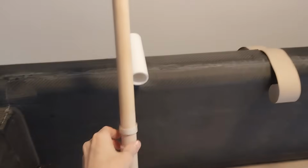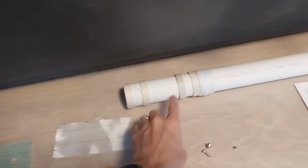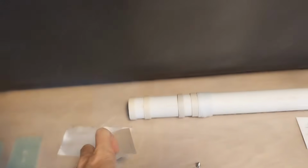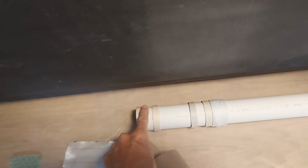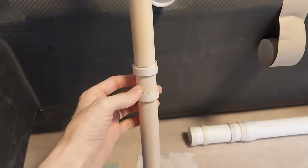The shafts for both the Windvane pole and the anchor light tower have to be thickened up a bit to fit into their housings. So the way I'm going to do that is I've wrapped some masking tape around to make these 2 channels, and I'll put thickened epoxy in there, and then using some stiff paper with some packaging tape on the inside, you can see it's kind of shiny there, I'll wrap it around there and tape it just to make it smooth and level with the tops here. That way these will fit more snugly inside their housings. And this one will rotate on it.